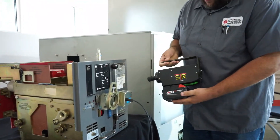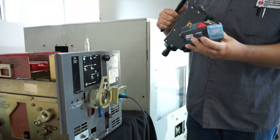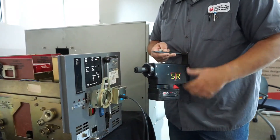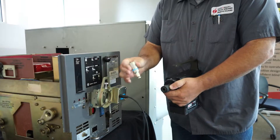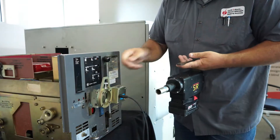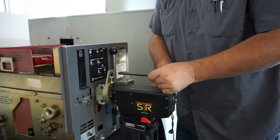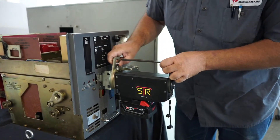You then take your universal motor, which has a 28-volt battery that comes with the kit. This motor is universal for everything — from 480-volt switch operators to MCC buckets all the way up to 38kV breakers. The tool adapter part is specific to the breaker and has a quick disconnect. Insert your tool adapter and make sure it's locked into place. Pick up the lock pin on your bracket, turn it so it stays out of the way, insert your tool adapter until it engages, slide the bracket back to meet it, and drop your lock pin into place.